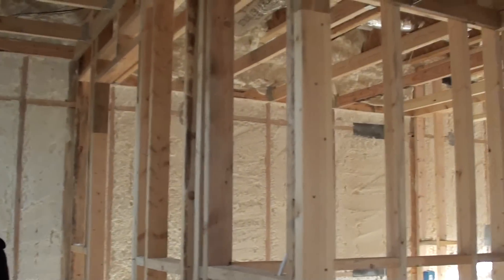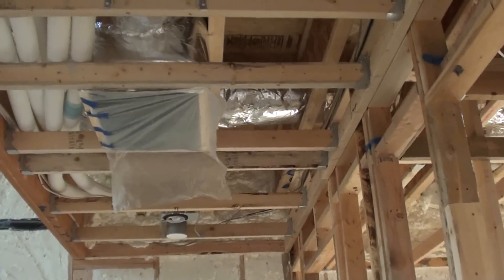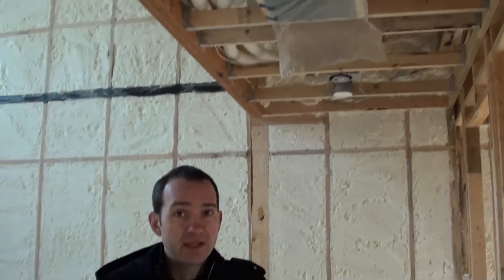We've dropped this ceiling about 14 to 15 inches to allow for this fan coil. Traditional conventional systems usually take up valuable floor space. One of the great advantages of these systems is that they're small and can fit into a lot of really small spaces. And other well-known advantages of mini splits — for most systems are ductless — is that they vary their electricity and refrigerant flow to match the loads at any given time.